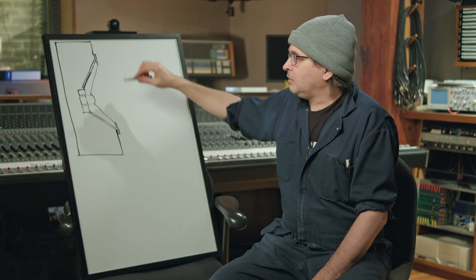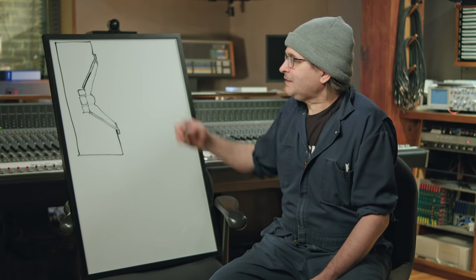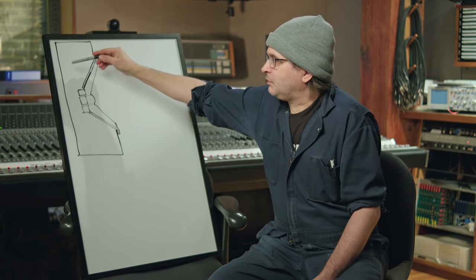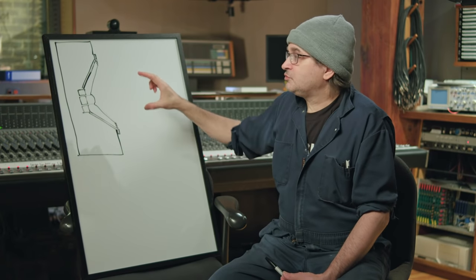There's an added benefit to that. When the microphone is very close to the loudspeaker, it's hearing all of these eccentricities at their highest level. And also the microphone can be exaggerating one or more of these eccentric sound effects. There are also internal cabinet reflections, that is where the sound is bouncing around inside the cabinet and where the sound is bouncing off of the mechanical frame of the speaker. And those short reflections create comb filtering effects and can dull the sound quality.